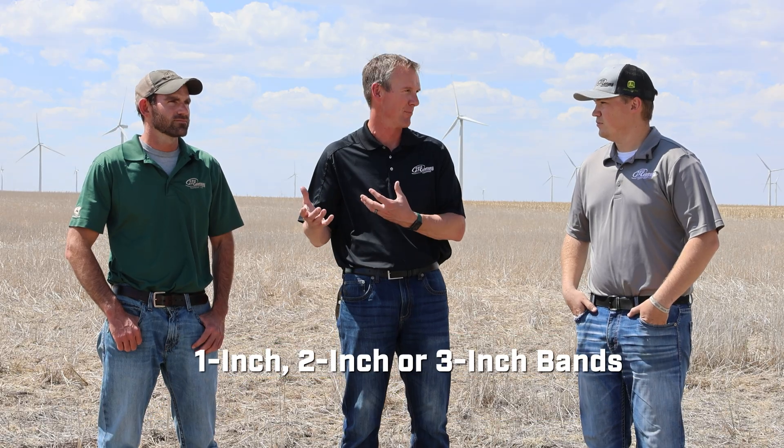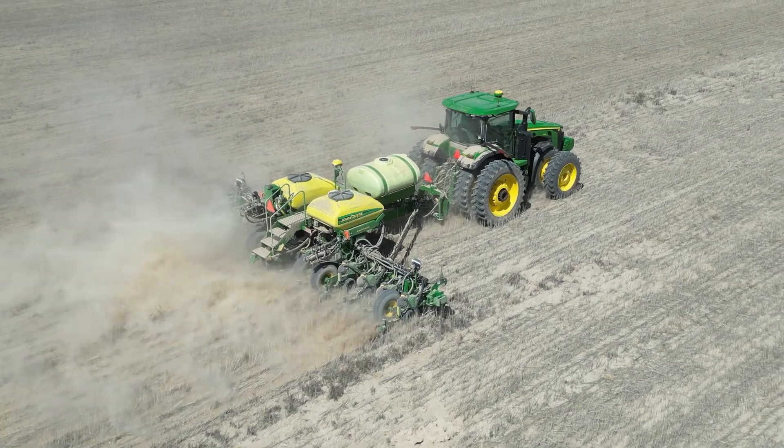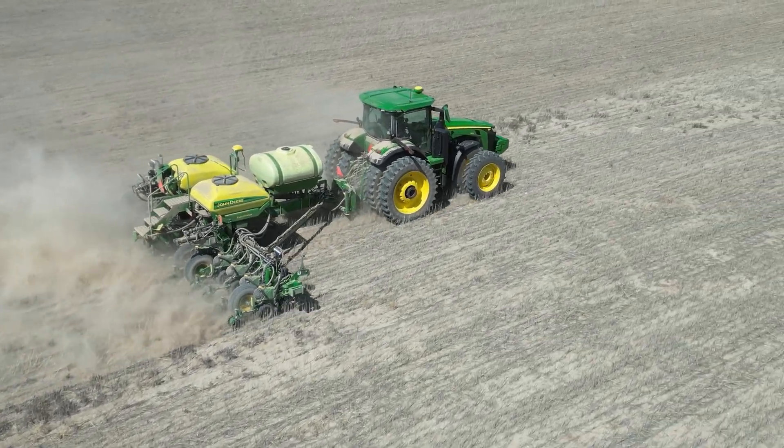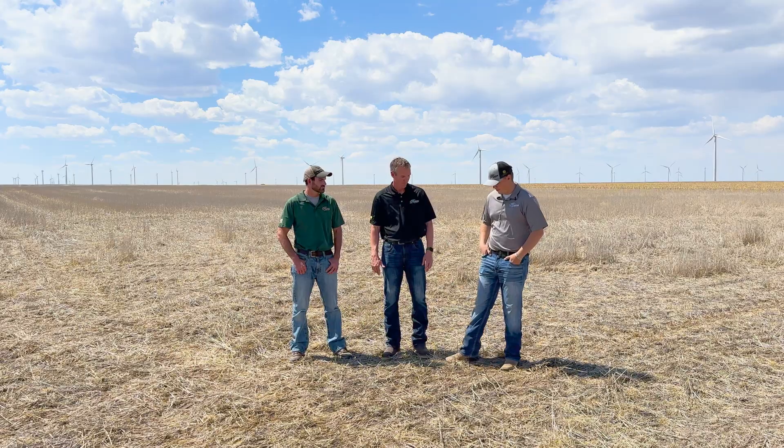As a reminder, you can choose a one-inch, two-inch, or three-inch band on the seed — he chose three. We started at three inches and were going to run some trials on two and three to see if we notice any difference, but since we were already saving on the 17 inches we figured we could get away with the extra inch. We're not in irrigated ground where it makes that big of a difference. We're out here in some stripper straw and it's been working good — every once in a while we see a little singulation issue picking up some trash but it hasn't caused any problems on the ExactShot itself.